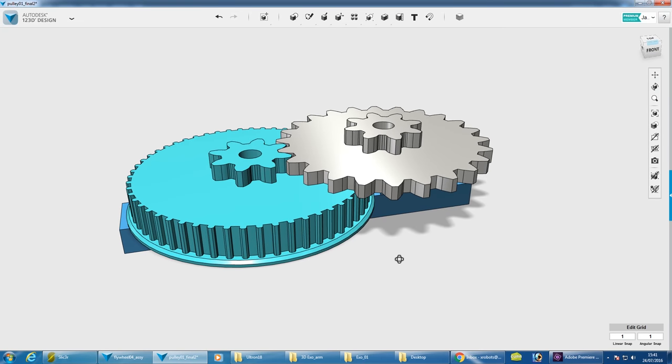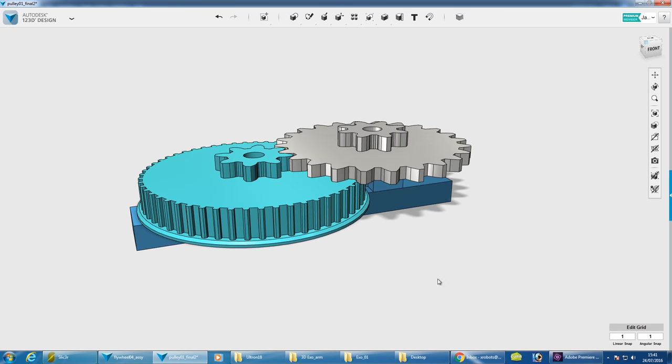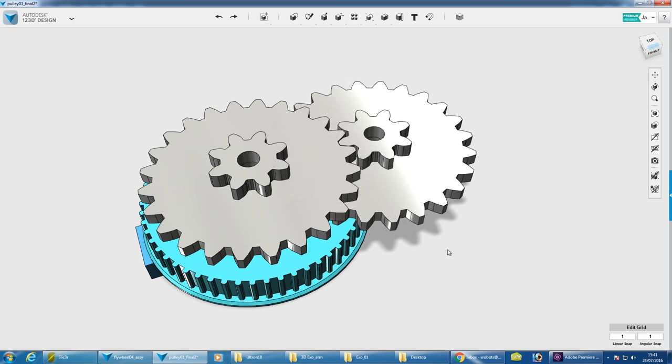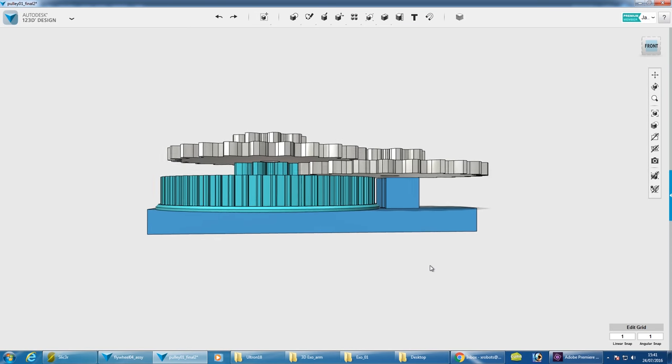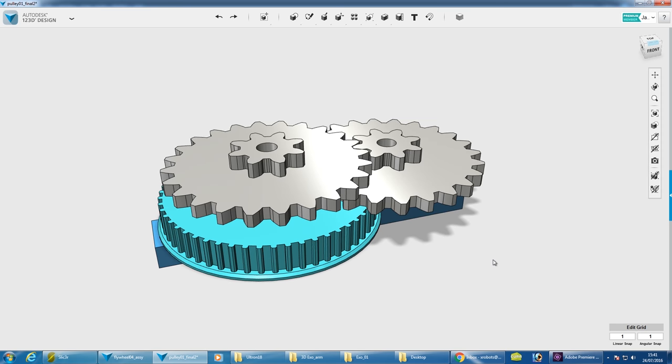Here's the gear train layout: I've got my toothed pulley and a small gear on top in turquoise, then another gear going small to big to small, stacking up on two parallel shafts until we reach the right speed. Each stage is a 3-to-1 reduction: eight teeth on the small gear and 24 on the big gear. It's not the best type of high-torque gearbox — a planetary would be better — but we're just going to do this and see how much reduction and torque we can get.